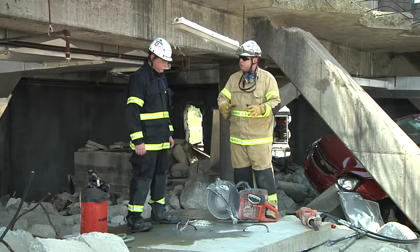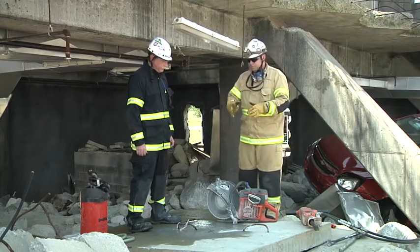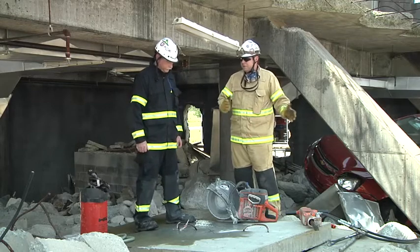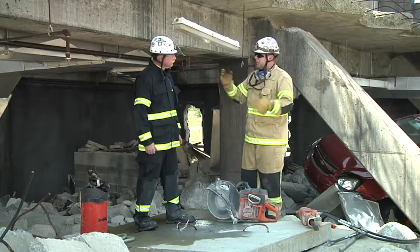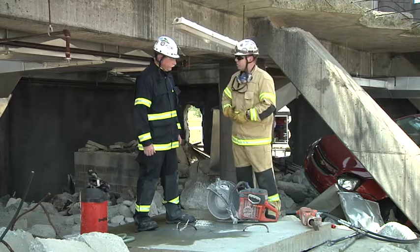What we're trying to do is punch through, but we're going to do a little chipping as we go. When we made our relief cut, basically all we did was take the 14-inch wheel and sink it full depth, and then maybe move a little bit, but not very much. That relieves the concrete a full 5 inches in depth at the center and then moving out. So we have a fracture line already started for us.